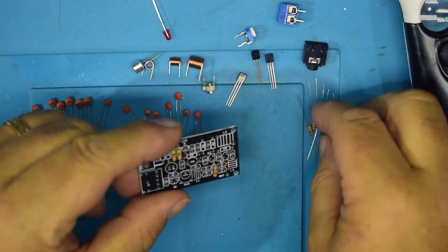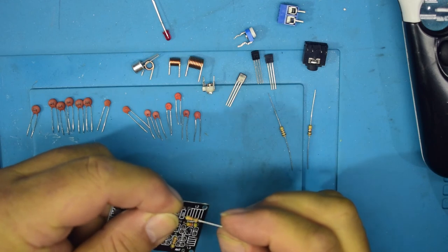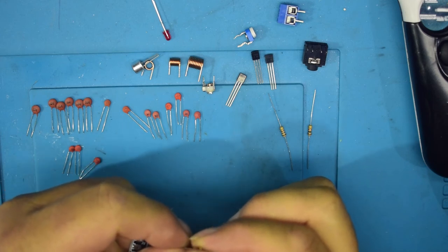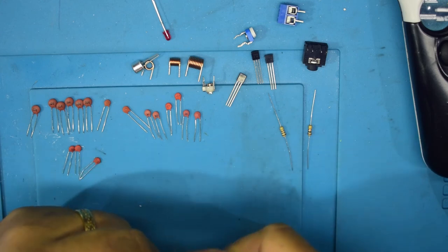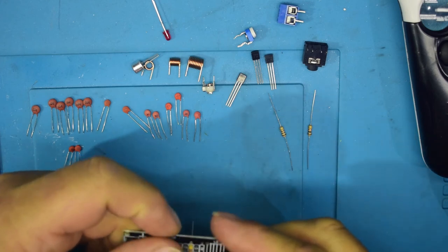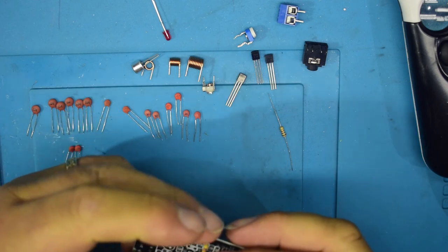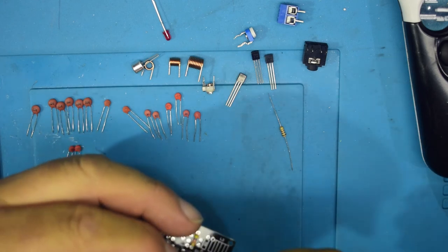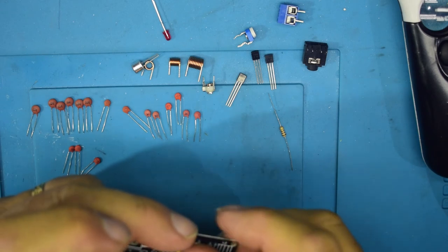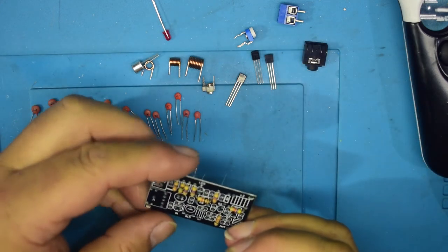So then what have we got? One, zero with 3 zeros, which is 10,000, so 10k. Do we have 10k? Yes, R4 and R5. R4 and R5, so there's R4, and there's the other 10k. Okay, so we're getting on with it quite happily here, now that I've sorted out my brain and I've put things in the right places.